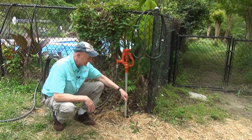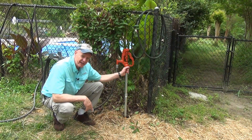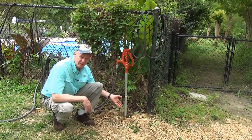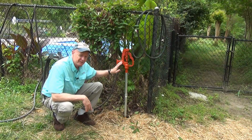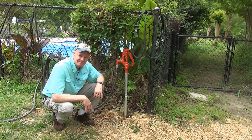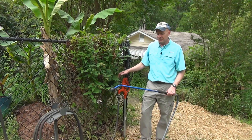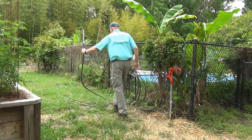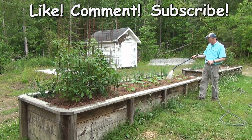In case you're wondering how you might do maintenance on this thing since the valve is two feet below the ground — it so happens that these hydrants are designed so that if you unscrew the head, you can pull the plunger out and service it. The only replaceable part is the plunger in the bottom and the seal on top around the little shaft that goes up and down. By removing the head, you can buy a kit to replace the plunger and the seal and you're good to go again. So if you need year-round freeze-proof water in your garden or your yard, then you should consider installing a yard hydrant. If you enjoy these videos, please help me keep them coming by clicking the like button, commenting below, and subscribing. Thanks for watching.